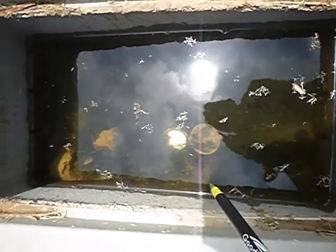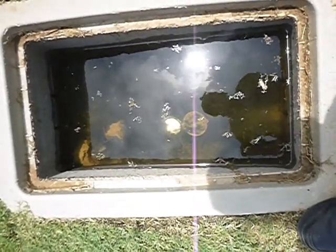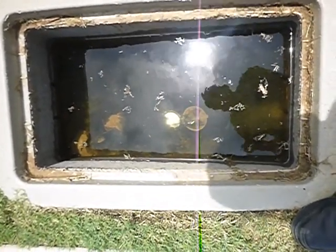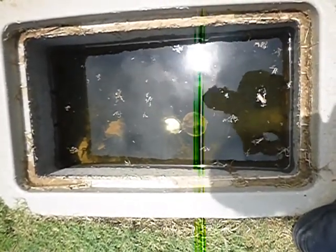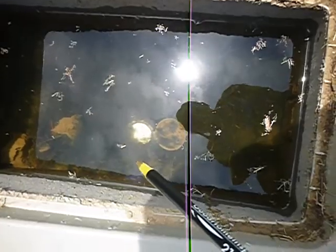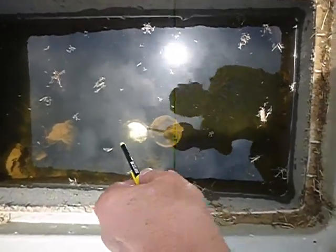If that wheel's turning and you can't see anything leaking, not a drippy sink or anything, then you might have a problem someplace that you can't see. You might have a leak in a wall or someplace. If your water bill is unusually high, you might want to come out here and look at that little sprocket right in there, that little red guy, that flow indicator.